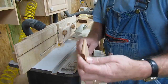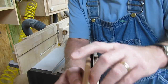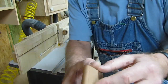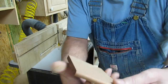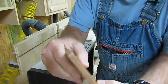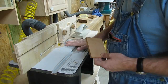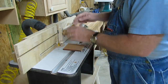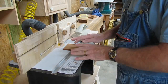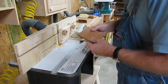Right here you can see the round over — I'm starting on it. So this is the start of your barrel, and we'll turn it up and make another pass back here, and that'll form us a barrel. I'm going to go ahead and make the rest of my blanks in this cut because we'll move the feather board and stand it up. So I'll go ahead and make these cuts, finish these out, and then we'll switch it out and do the other side.